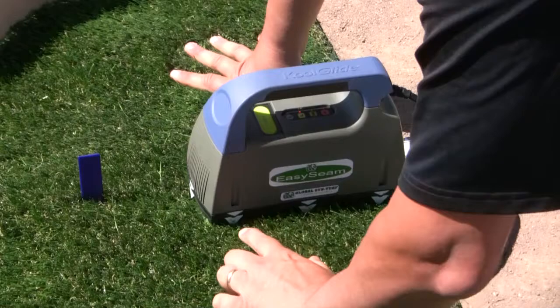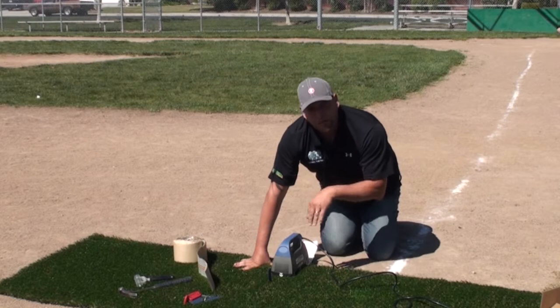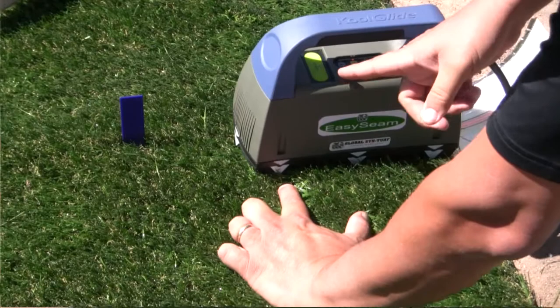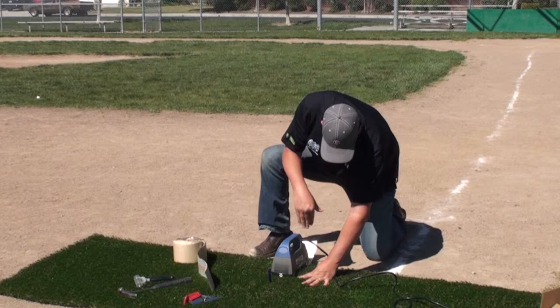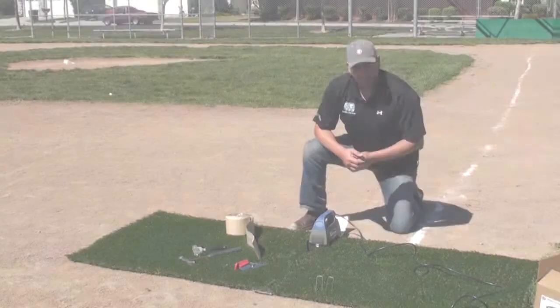What I do is I place my finger on the front of the machine, because the activation of the radio waves goes down through the turf and activates the glue on the tape — it activates between both of these triangles. So I get one finger by the front arrow, take my other finger and push the power button. The light comes on in the power button, meaning it's activating down through the turf and activating the glue on the tape. When the light goes out, it means we're done activating in that area. It's as simple as that.